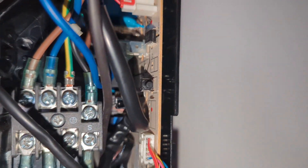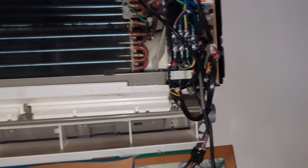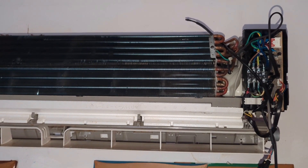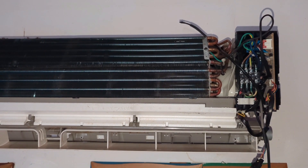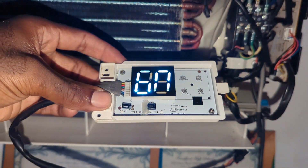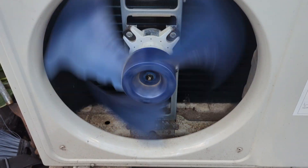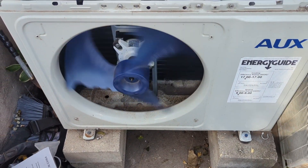I had to reset it once it turned on. Press the switch set button once to turn it off, then immediately press and hold it until you hear two beeps — it's going to show 'LL' on it. Then you can set your temperature and test if everything worked fine. I checked and everything worked fine.